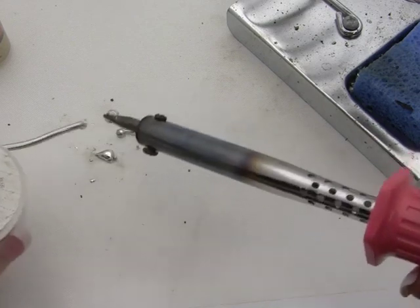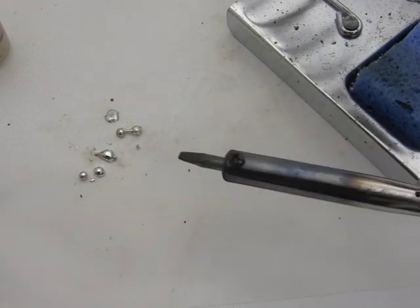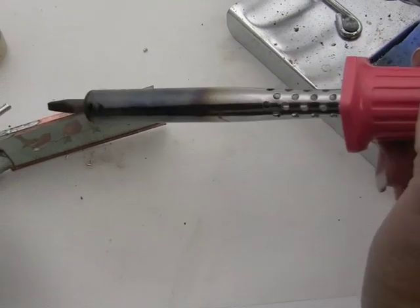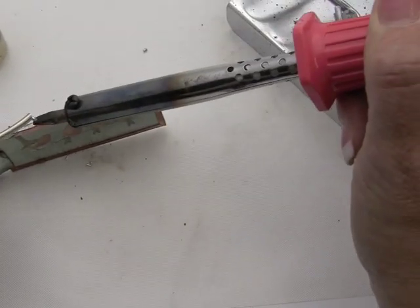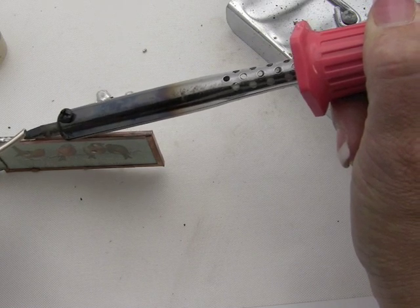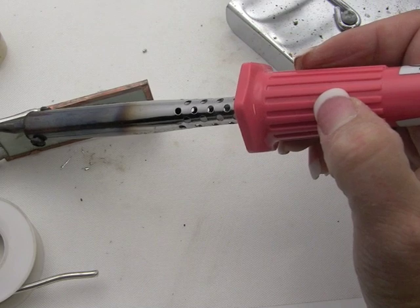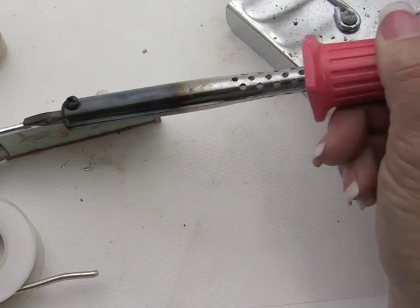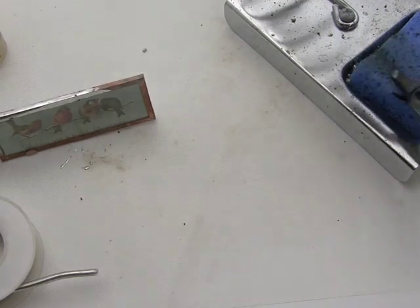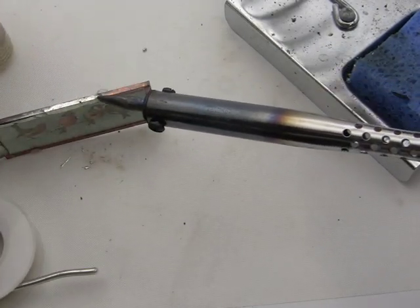Sanding it off - I may need to sand this off again. Melting the solder on and re-melting it on there, and getting it tinned, is the key to getting that tip back to working. I'll come in with some flux and start working on a project. I can see that it starts to melt - got a little bit on there - and with that I can just take this tip and go right over and melt that solder on there. It's working. It's still a very blackened tip and needs more time to be cleaned and tinned properly. Wipe it off on my wet sponge - we're getting silver back!